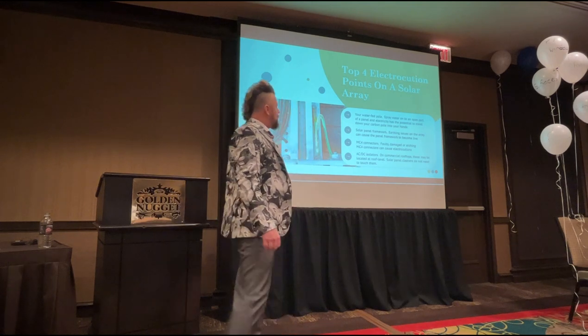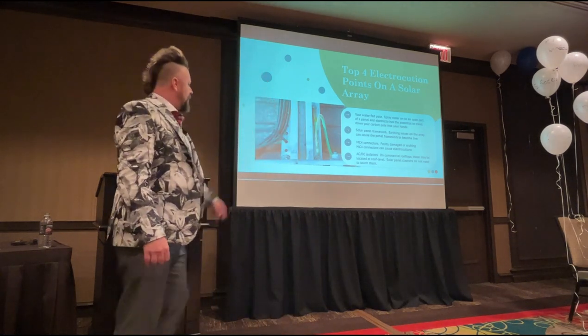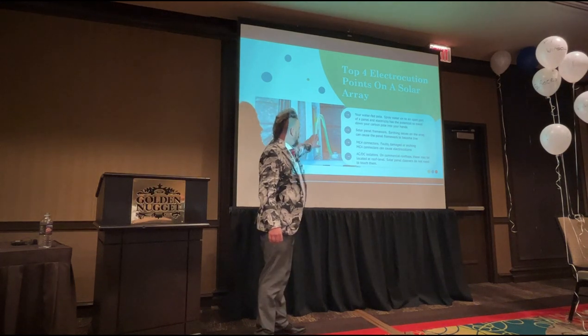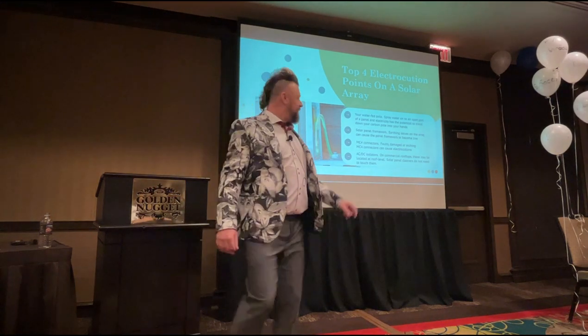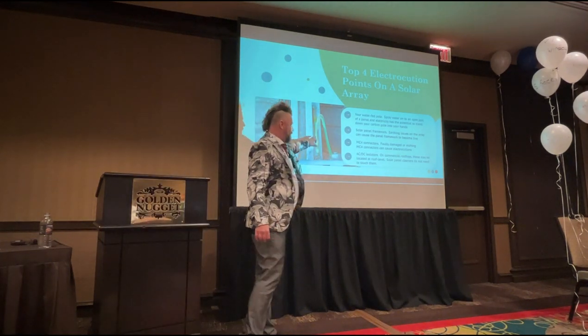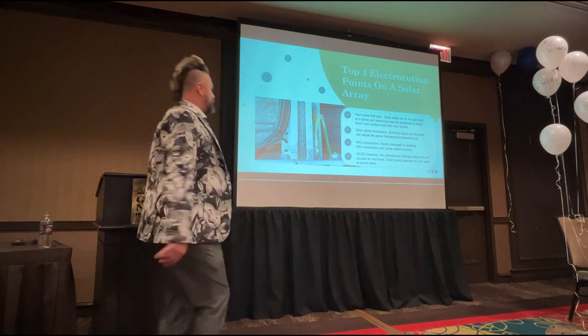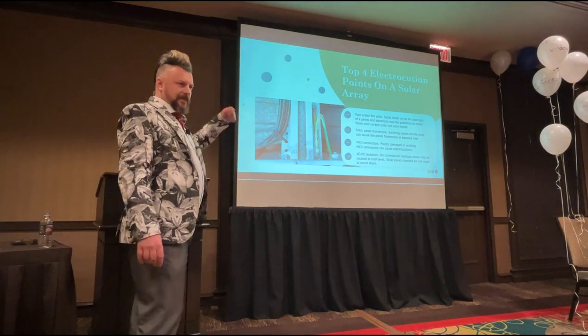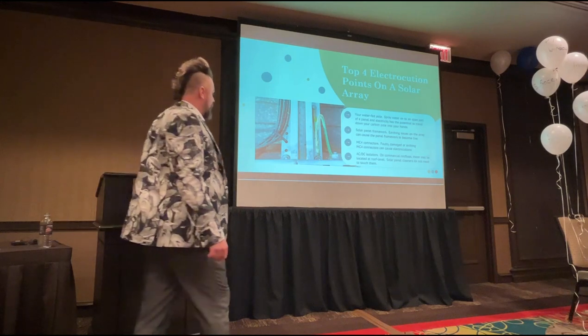Your second point, solar panel framework. Earthing issues. Here we've got an earthing issue. This earth cable here is damaged. Rats chewed through that cable. We've got the video of the dead rat in the gutter. So the rat had chewed through that, got his electric shock, and he's now dead. So if we go spraying water onto that, there's a possibility that we can get an electric shock from that.